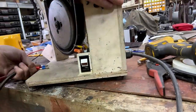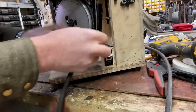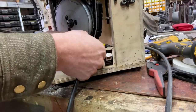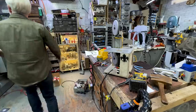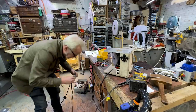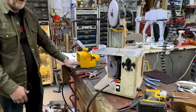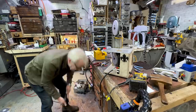Connect this up here, and this will be the switch operation on those switches. I've got some heat shrink I'm going to put up there, but first before I do that, I just want to check operation. To check operation, I'm going to plug in the machine — it shouldn't turn on. Great. And it should turn on when I hit this switch. Very happy — that's great.